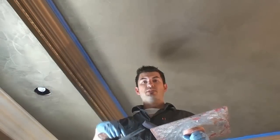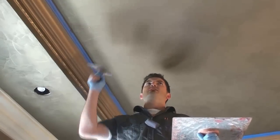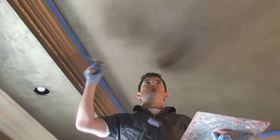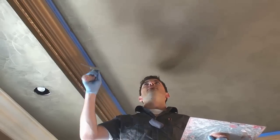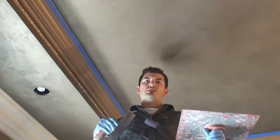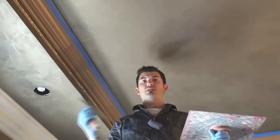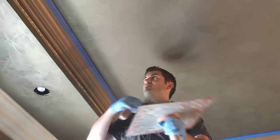For my final coat, I've thinned my material 10 to 20%. The reason I did that is it's just going to slick it up and I'm going to get a nice, clean, tight coat — it's going to polish this up and really make it kind of glow. Just have a plan to get going on this one. It's going to be a thinner coat so it's going to set up a lot faster on me, so I need to really keep it moving or I'm going to get a hard line. Get ready and keep moving with it pretty quick.